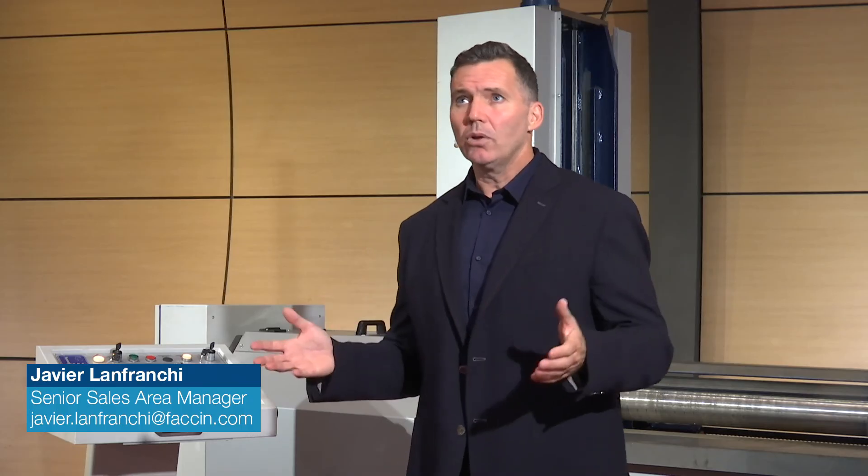After this presentation, you may be asking yourself some questions. The most common: how long does the rubber last on the bottom roll? In the past, the roll had to be changed quite often because it was easily damaged by badly cut pieces of metal plates — the burr of the plate edge was sometimes as big as the plate thickness. But the quality of modern cutting technology is certainly much better than before, so the polyurethane coating can now last many years.